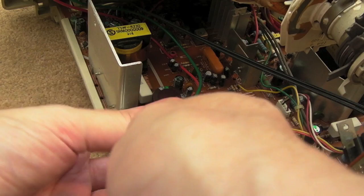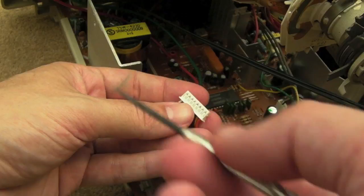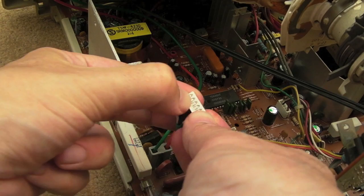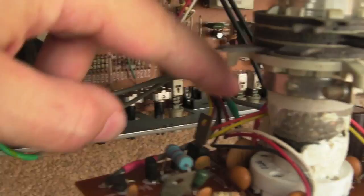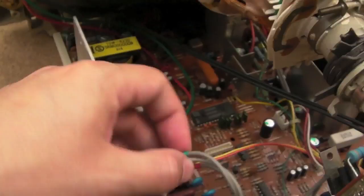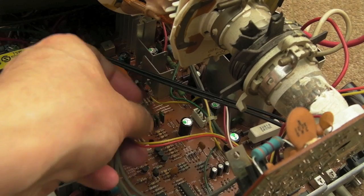So if you swap them around that way - something you want to be careful of, you don't want to damage the connector. You can see it's gone back together okay there. You can bend the little metal clips up with a pinhead before you stick them back in, just to make sure that you've got maximum area there for it to clip on. Also just press down on these when it's firmly pushed back in, just to make sure you've got a nice good fit. The other way of achieving the same thing is, obviously, if you follow these wires they come up here in pairs, so you can just desolder them and resolder them there. But I find it just easier to do that - it's kind of non-intrusive, and if you're careful you won't damage the connector. You might not even need to do that if you've got the scope on there - I would have, that would have been a clue.